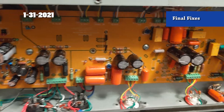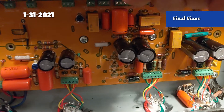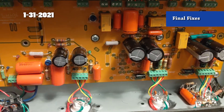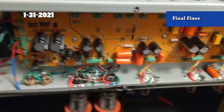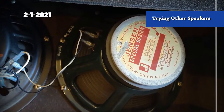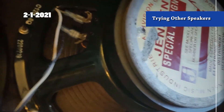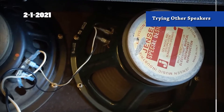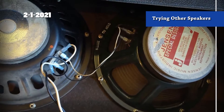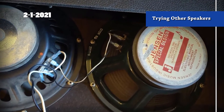All in all it's working. I also had to replace the last resistors off of B5 with 150k, just like you always do if you don't use the FET circuit. I'm about to steal this Jensen out of one of my Twin Reverbs - my beat up twin with random speakers. It's one of the C12Ks that would have come in a 65 Reissue Twin. It had a lot of clarity and fat low end with the Blues Deluxe circuit.